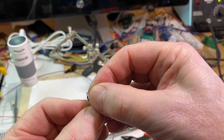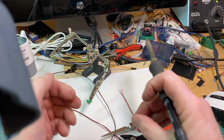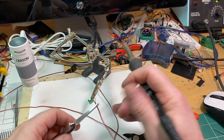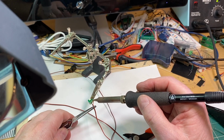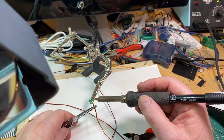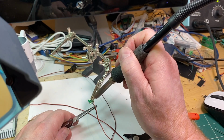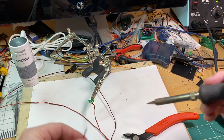Now here we're going to solder the red common and the first of the connections, and I'm going to bend them in a kind of a parallel fashion. This just makes the soldering task a little bit neater. For this task, I'm holding the camera, soldering, and you're looking over my shoulder. You just see I tapped that existing solder pad very briefly, and then we shift the wire a little bit to get the next one over. So it goes very quickly, done the right way.